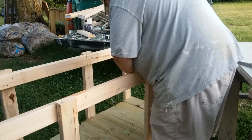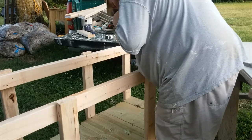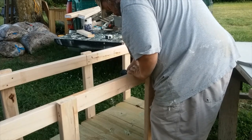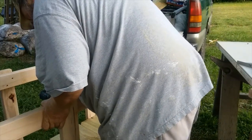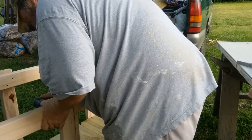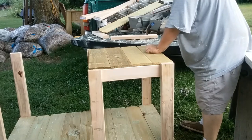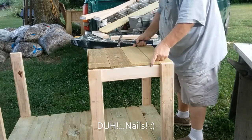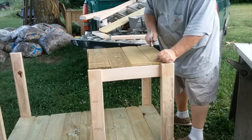I'm fixing to cut this one off. I should have secured it with a screw before I cut, but I didn't. I got a little pinch from the looseness, but it was nothing for that Bosch circular saw — I love that saw, it's been my right arm. I never thought I'd use it as much as I do when I first got it. I went ahead and cut these two-foot-wide planks and nailed them down with inch-and-a-half galvanized screws.